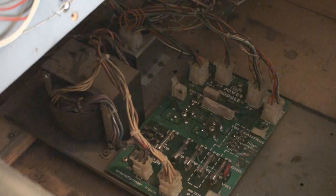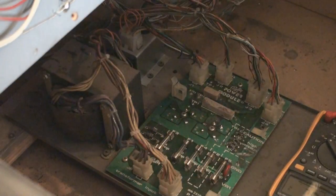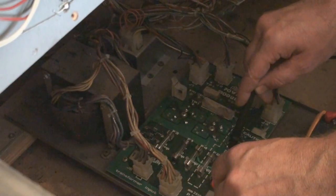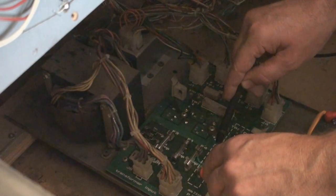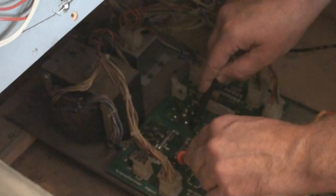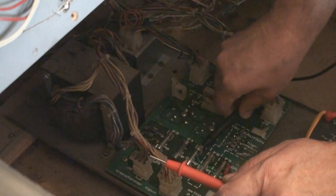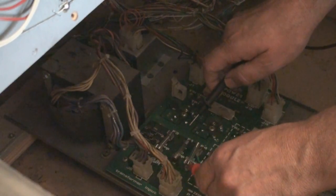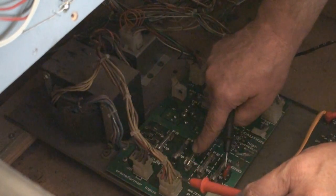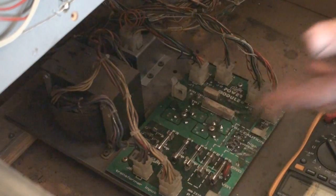In this case, I'm just going to end up taking my multimeter here. And make sure the power's off, guys. Unplug it when you're doing this, okay? And I'm just going to check on both sides of the fuses using the diode tool. Okay? Because that will tell me there's continuity between these two. Like I said, it's usually good to actually pop the fuse out, but I'm going to show you something. This fuse I popped out, and now by testing these two points, we're not getting anything, but here we do. And that's why I know I can get away with doing it the way that I did it. Okay. So that's the first thing. So we know the fuses are good.